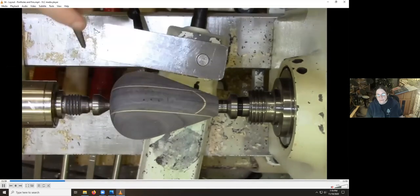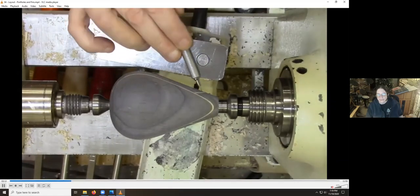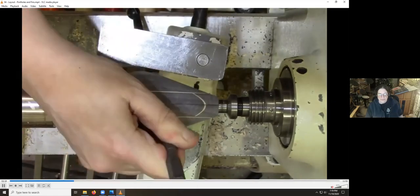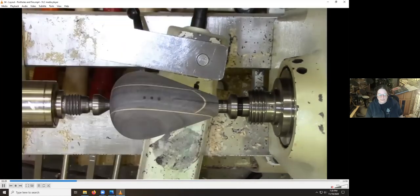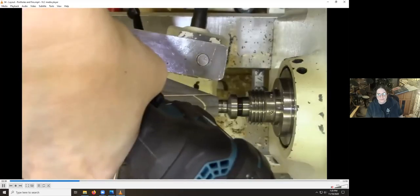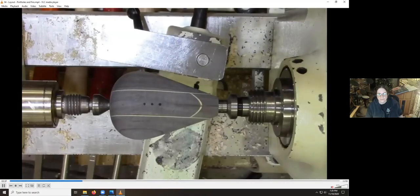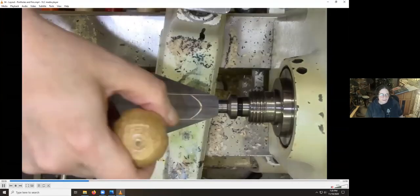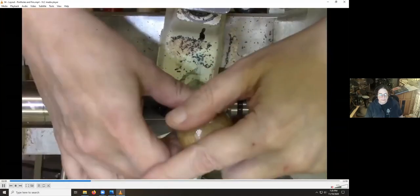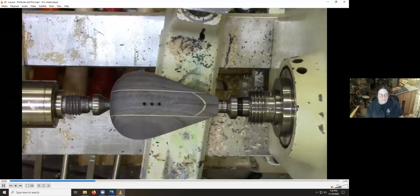I'm using a center punch to mark my spacing of my portholes, then cleaning up the lines. One thing about this aloe wood — whatever they used for the resin makes cleaning it up really easy; it makes little chips or dust but cleans up and sands really nicely. It's not fun to work with because of the dust. Now I'm drilling pilot holes for the portholes. I'm going to be using eighth-inch maple dowels for the porthole inlays, and this is probably a sixteenth-inch drill bit for the pilot holes. I'm going to countersink with a hand countersink just a little bit to break the edge so that when I come back with the larger drill bit I don't get as much tear-out — just a little trick I picked up somewhere.